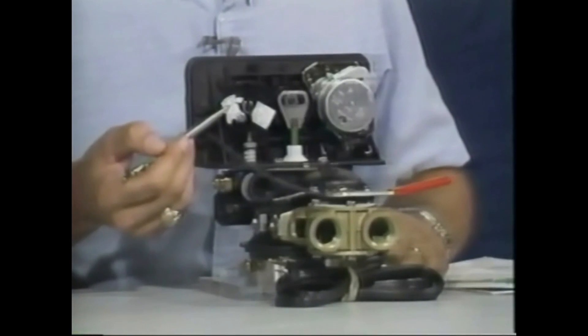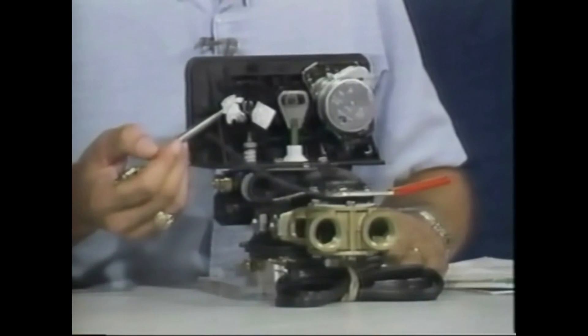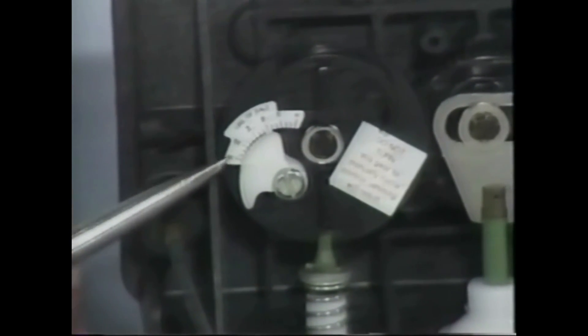There are two different labels available. There's a 3 to 18 pound salt scale, which simply tells me that the brine line flow control button is refilling the brine tank at a rate of a quarter gallon per minute. Or the second scale we might run into would read 6 to 36 pounds, which tells me we have a half gallon per minute brine line flow control button.